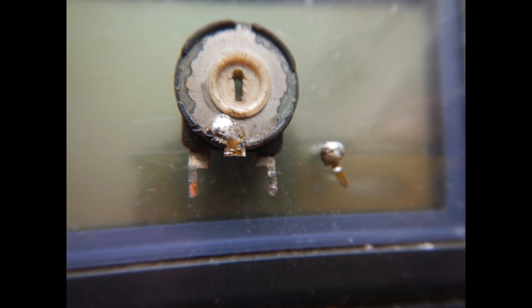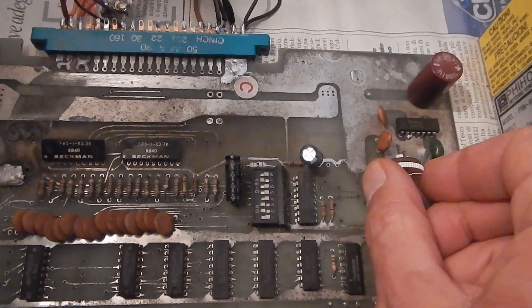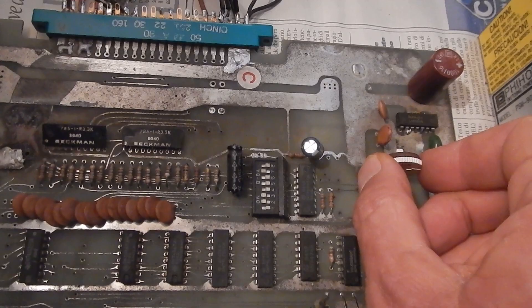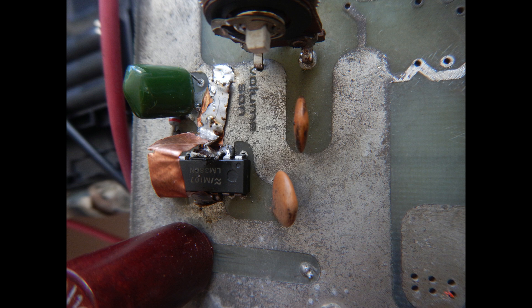While I was substituting the LM380 amplifier, I noticed that the audio level trimmer had a broken leg that was repaired in the past life of this board. The old trimmer was still working fine, but I decided to install a new one with no repaired legs. With the new LM380 all sounds are back to normal. Since all the heat produced from the LM380 IC needs to be dissipated to the surrounding PCB only, I thought I'd add some copper strip to the heatsink pins of the amplifier. This is probably unnecessary in reality, since the IC seems to never get really hot, but it can't hurt.